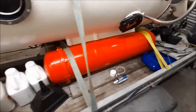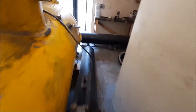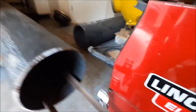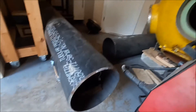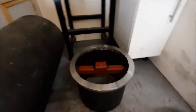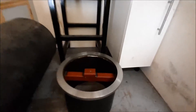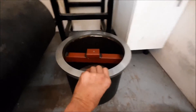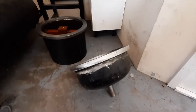I'm making the battery pods pretty much exactly the same as I did on Jodi B. There's a removable end cap which is bolted on — just going to do that slightly different. I've got 12-inch A106 pipe, standard weight, same size. I've made the battery trays with wheels on this time so you can pull the batteries out a lot easier. I've chopped a length off and machined and welded that one ready, and this is the end cap which is ready to be machined now.